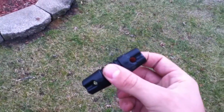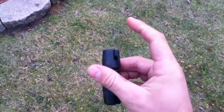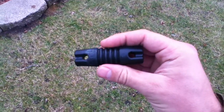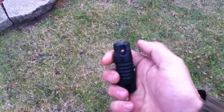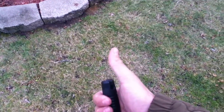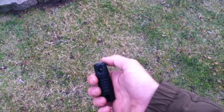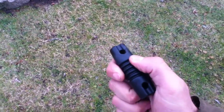Real quick — the dog bone. When you're doing a dog bone dipole, you've got your feed line or your hard line going through here, and then your cord — paracord or dacron — going through the other side. When you're tuning these antennas, it's very easy to tune dipoles. What you do is, when you put the feed line through and wrap it around several times, you can actually adjust the SWR with just that, because it's feeding back into the antenna for the SWR. You don't need to trim it at all. Just wrap it around and keep going back and forth on both sides until you get a perfect SWR on the band. So it's a pretty good thing.